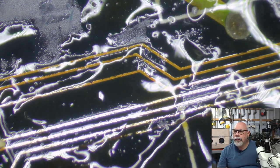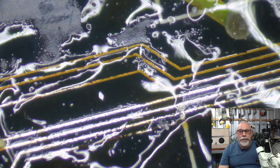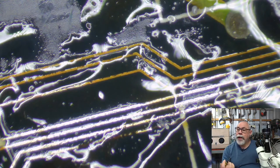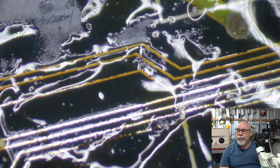Look, I read these things in the worst order, don't I? That's exposed copper. Isn't it covered in mask? Well, yes, it is covered in mask. But what has happened is something has landed on top of the mask. Namely, a little bit of either electrolyte from a capacitor or alkaline, it's usually electrolyte as well, from a battery. And it's landed on there and it has eaten through the mask, and then got onto the copper and caused the copper to then corrode from underneath and push up.